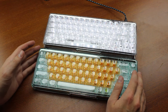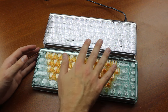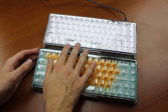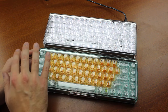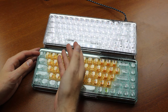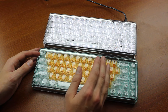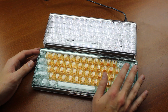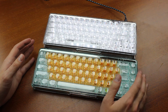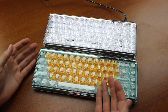Interestingly, both use white-only backlight, which is a funny choice. If you want white light, you basically have to use white-only LEDs, as white looks really bad if you try to make it out of RGB LEDs — the colours are never right, giving a kind of sickly pale yellow with flares of red, blue and green everywhere on the keyboard. I reviewed an old Logitech with monochrome white backlight ages ago that had the same train of thought, and I think it's the right approach if white light is what you want, even if it makes the keyboard look kind of boring.